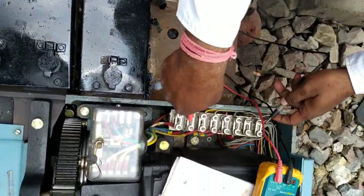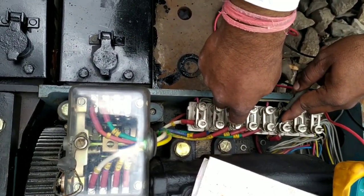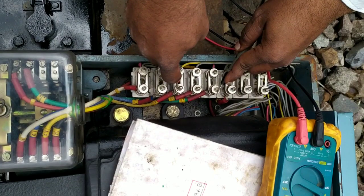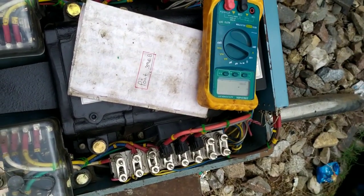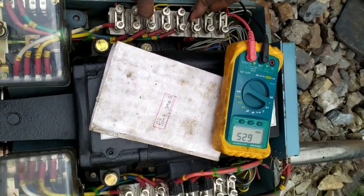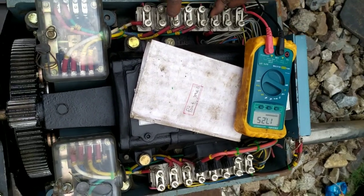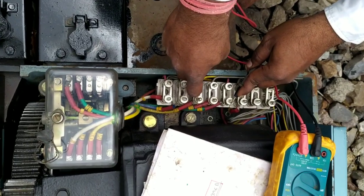The IRS type point machine is operated at 110 volt DC. To get 110 volt DC, the point must be under operated mode; otherwise you won't get any 110 volt on your multimeter. Always remember that the point must be operating while you are measuring the voltage.